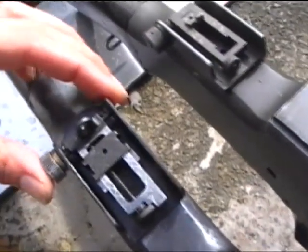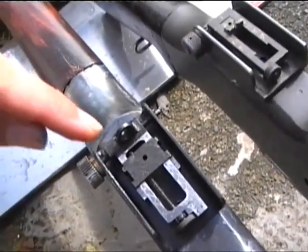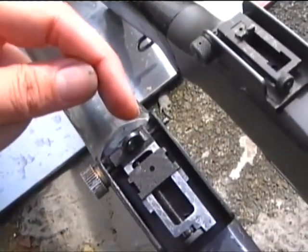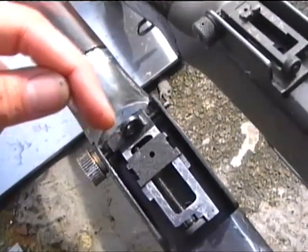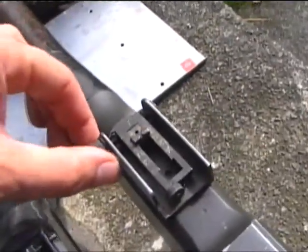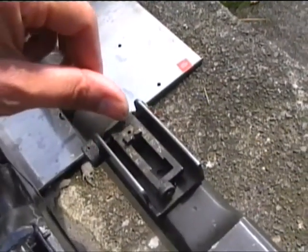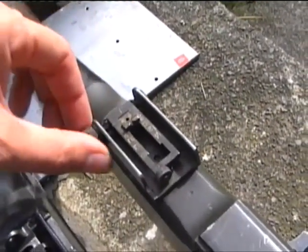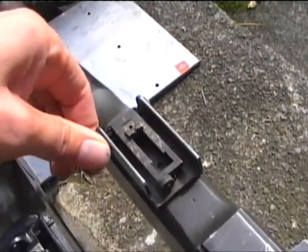It's not completely finished. What I've basically done is I had to put an M4 tap through the rear end of here to make it work in the same way as this one does. You'll see there's basically a thread running in a hole going through the rear of the sight, and when you turn that, it moves the sight left and right.